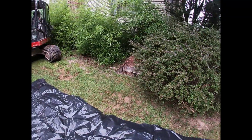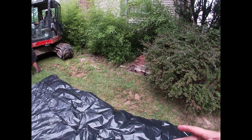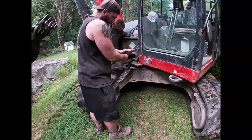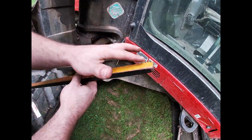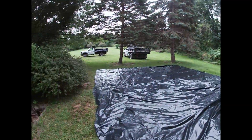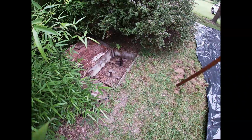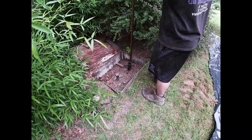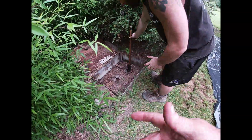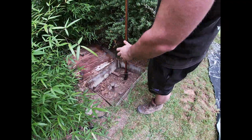So anytime that I'm going to do a tank installation with my removal, I always stick the tank and we check for water. Sam's applying the water detecting paste now. That turns red if there's any water in there. So we'll stick it, we'll determine how much product's in it, and we'll see if it's got any water. If it's got any water, then I set up my drop tube that far off the bottom so we don't pump water into their new tank.